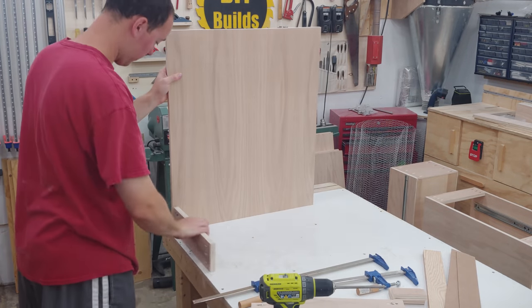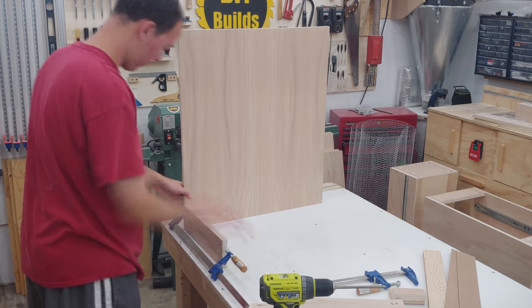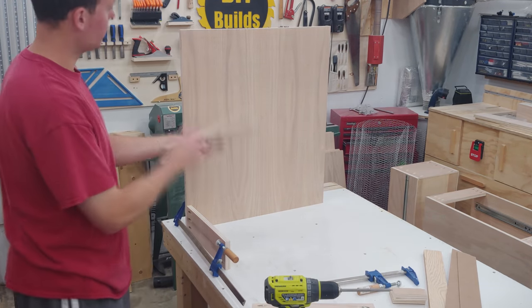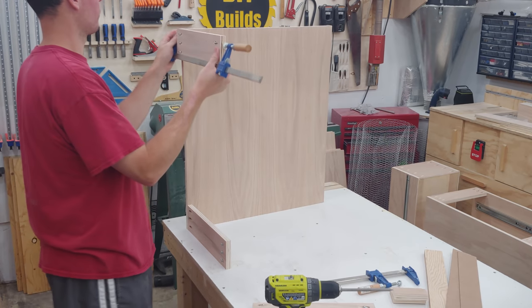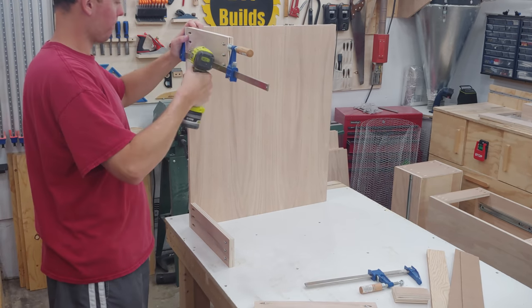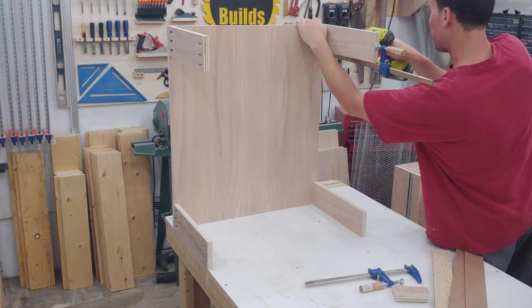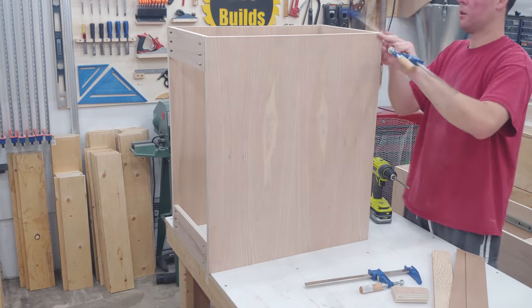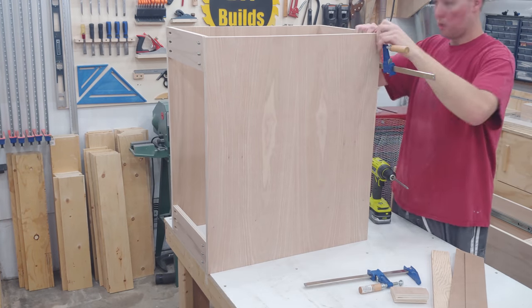Now on to assembly of the 2 drawer banks that make up the outer legs of the desk. There are 2 large panels with edge banding on the front, and 4 stretchers that get attached via 3 pocket screws at each joint. 4 stretchers are identical, but one of them has edge banding on the front, and this will be the bottom front piece, which will be stained and visible at all times. Again, clamping while using pocket screws is an absolute must.